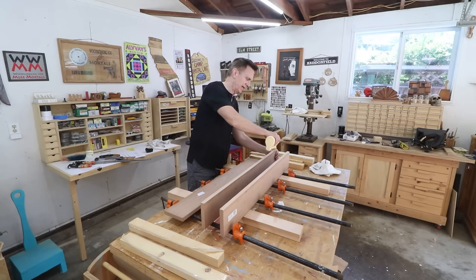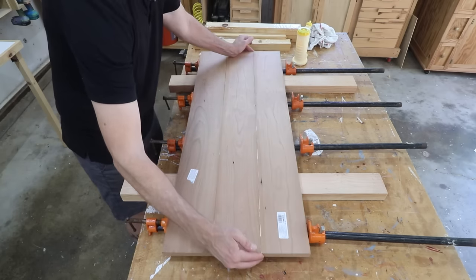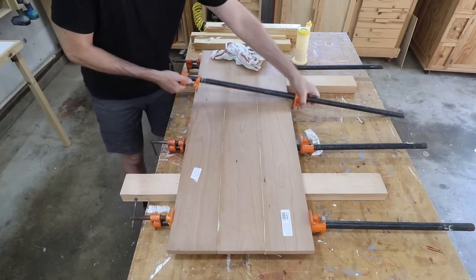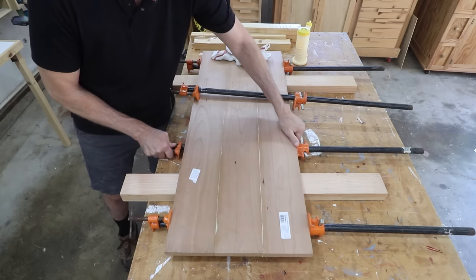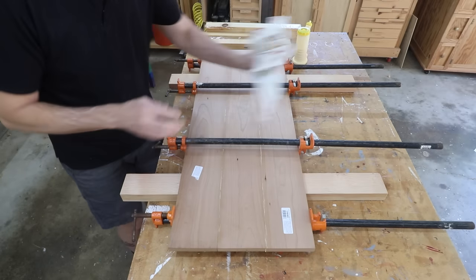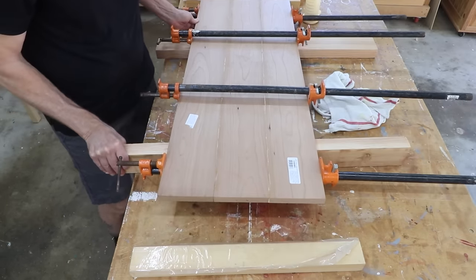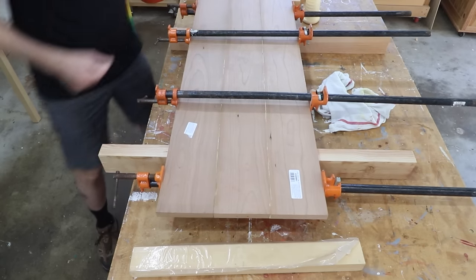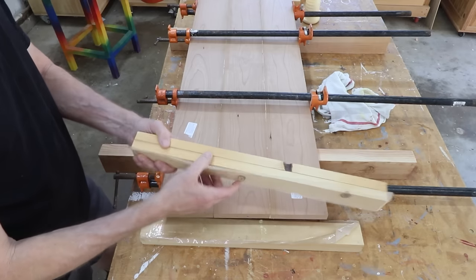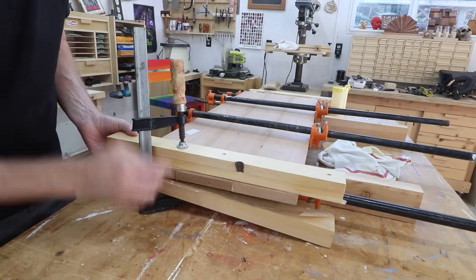All I've got to do is put some glue on the edges of each of these boards. I'm going to put these on the top side. Now before I tighten this down, I'm going to put these clamping cauls in place — it's just to raise this up. Now I can get these underneath here to flatten the boards out. These are just boards that I've screwed together with a piece of plastic packing tape on them so that the glue doesn't stick to it. I'm going to put the pressure of these clamps right on these joints.